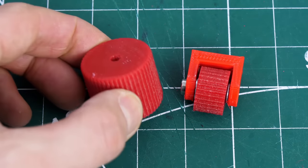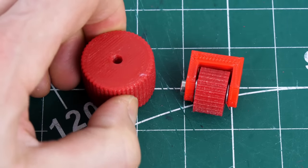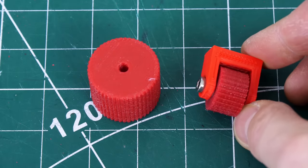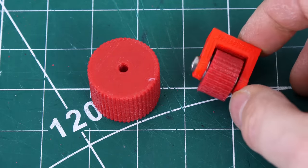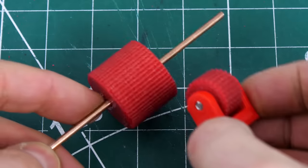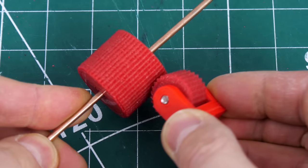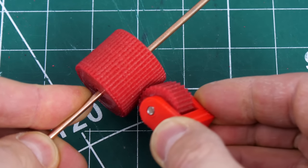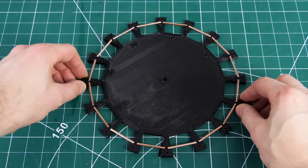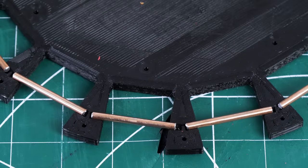So there are two sets of rollers in this project: the big wheels that go round the outside of the main wheel, and the little wheels on the hubs. Both of them are printed in TPU, which is pretty flexible, and the small wheels are mounted on a mount with a bolt and a washer either side. If I get one of the big wheels and the little wheels and put them on an axle, we can see that if we rub them together at a 45-degree angle then we pretty much get the desired result with the big wheel rotating. My main wheel mostly consists of a hub with lots of axles around the outside to put the small output wheels on.